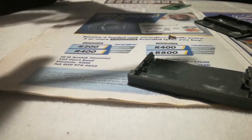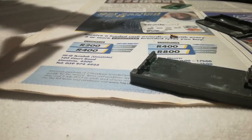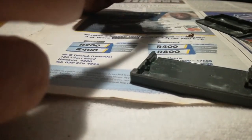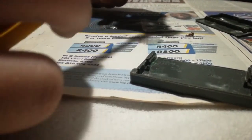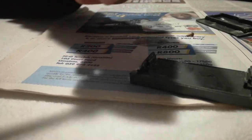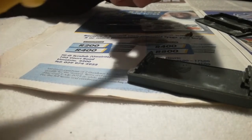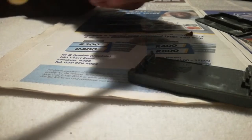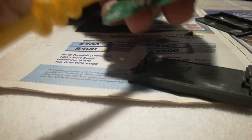I've got a toothbrush — very fancy tools — and some window cleaner. I'm not sure what it's called in America; it might have a different name. If you know, let me know in the comments. All I'm doing is on that gold ribbing, I'm giving it a bit of a rinse with the window cleaner. You also want to have some toilet paper handy just to give that excess a wipe off, because if you don't it could cause short circuits, and we don't want that.